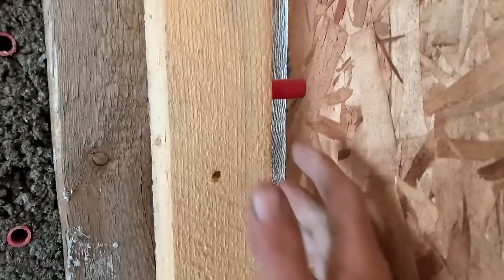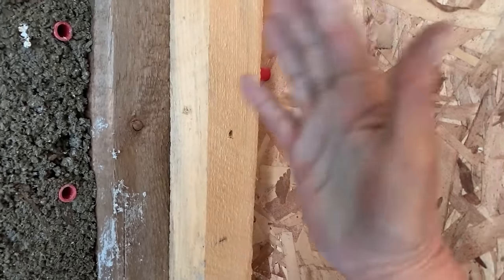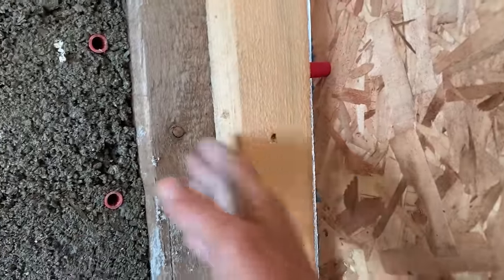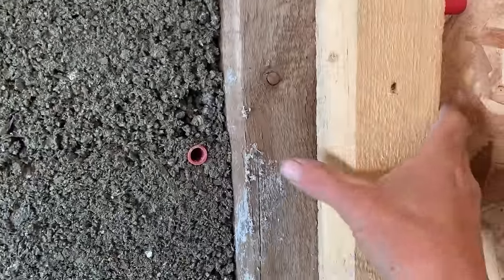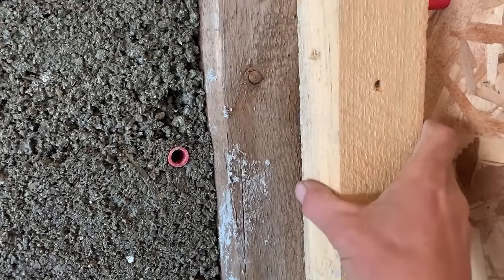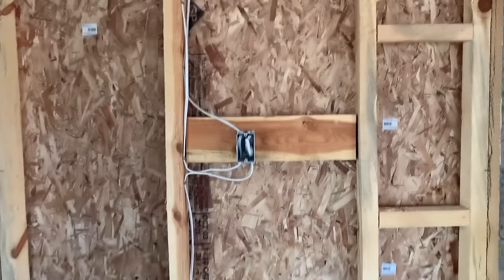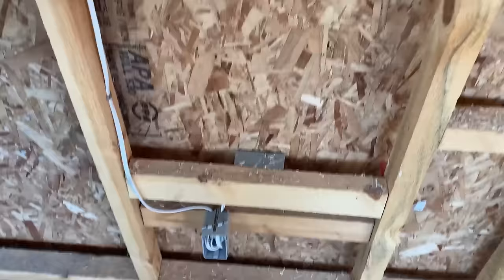And you can see that I'm using these little sections of PEX plumbing tubing as spacers. There's a screw coming from the outside through that, attaching it to the frame. So then this will act as a cleat to keep the wall from wanting to tip. And it also allows me to hold the forms away from the frame so that they're completely encased in the Dustcrete. And that prevents thermal bridging through the different density of the wood and gives you a more energy efficient wall. So this light frame also gives us a scaffold upon which to mount our junction boxes and wiring, plumbing, things like that.